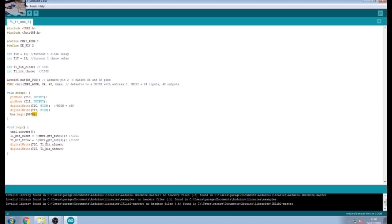The bus begin is the same as what I've done before, so I'm not going to go over that. In the void loop, the first thing I'm doing is CMRI process to start it, and then we read the bits coming in from JMRI and store them into the variables we set up. We do CMRI bit 0 — which will be address 1001 — and CMRI bit 1 — which will be address 1002. The only thing different here to my last servo code is this exclamation mark.